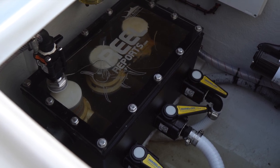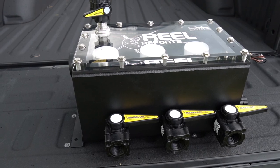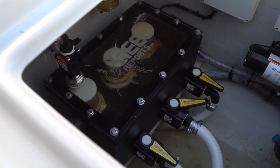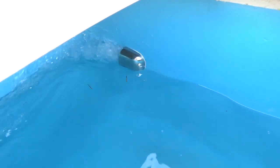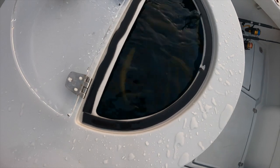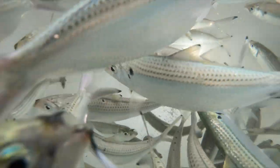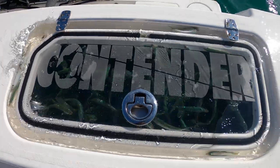The nucleus of my entire livewell system in this boat is the Best Marine pump box. The durability and construction — this thing is built for war. It features valve controls, it's got a purge on there, and we've got three 1500-gallon bilge pumps in there that are completely submerged, which increases the life of those pumps because they run cooler. The valve controls control the inflow to the bait wells — each bait well has its own inflow and I can control how much flow goes to each one. If you don't want to blast your baits — say ballyhoo — with 1500 gallons of water per hour, you can bring it down and slow it way down so those baits get optimal water flow and swim correctly. It also helps me control the pressurization, which is key to eliminate slosh in the bait well. It's all about water flow, and that's why we have valve control.